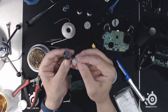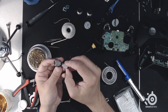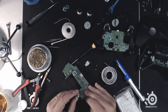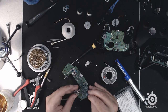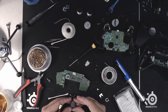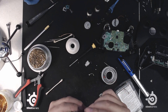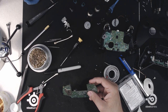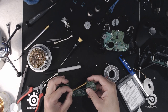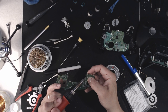The new parts come with two small tabs on the bottom — I have to cut those off in order to get the part to sit flush when adding it back to the top of the board. I'll do that and then solder it down. That sits pretty nicely on there. To solder this back on, we're going to add some flux to all 14 of our solder points. Then we'll just tack down one point first, and then we can go over the rest all at once.